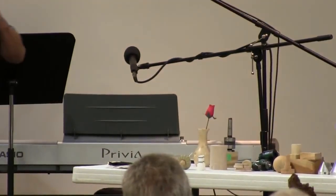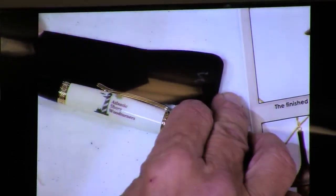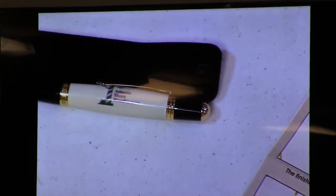One more thing to show you — this is so cool. Gary made this piece. He used mahogany because it has a fine grain — he had some real nice fine-grain mahogany. He just spun it, CA'd it, sanded it, and put a CA finish on top. Really impressive work.